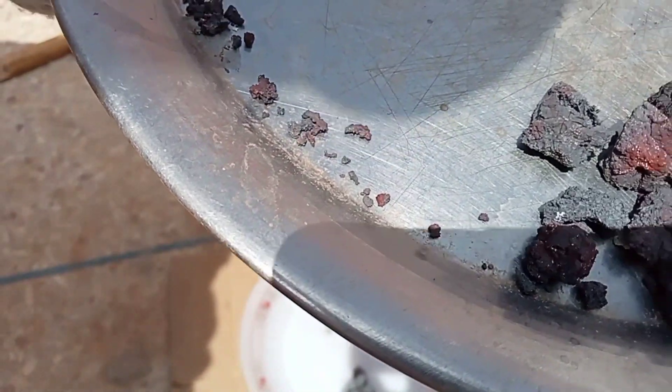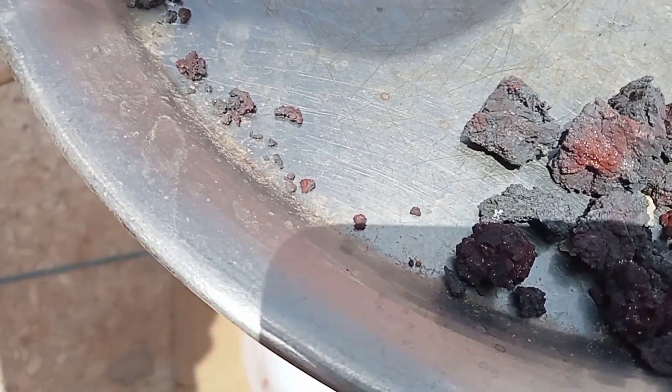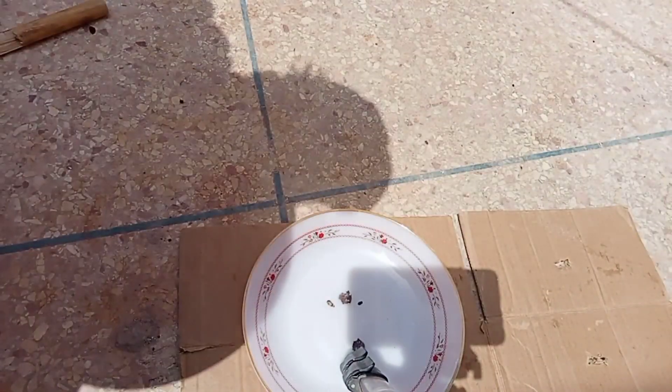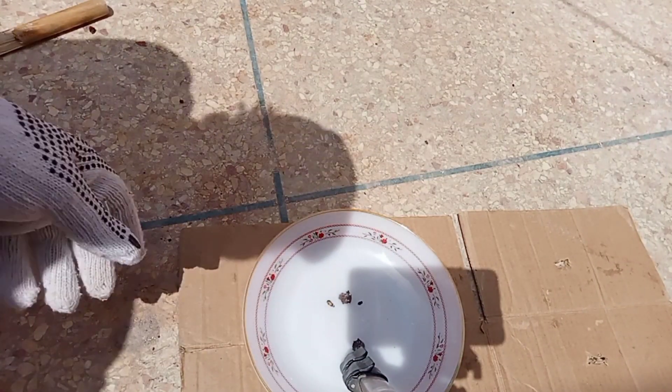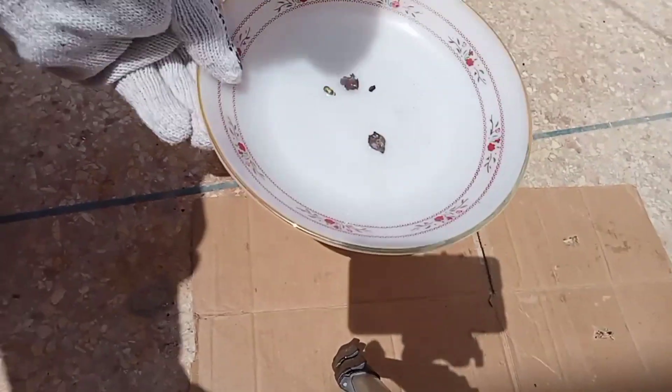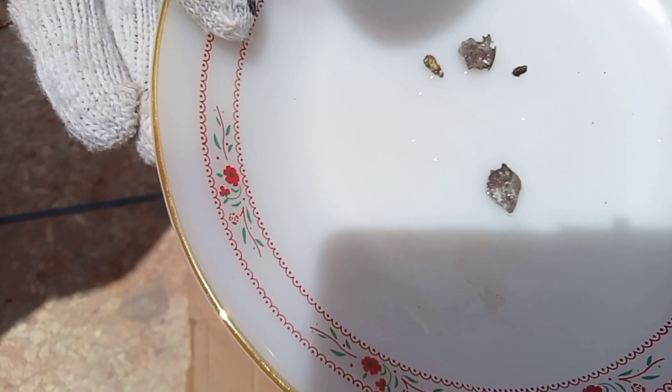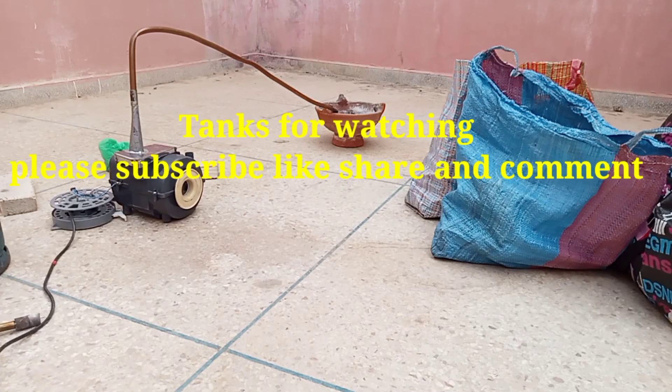Should an ore that is a metallic oxide be raised to a high temperature in a zone containing excessive oxygen, it will not melt. If a metal in its pure state is melted or heated to a high temperature in a zone of combustion that contains excessive oxygen, it quickly oxidizes into a metallic oxide.